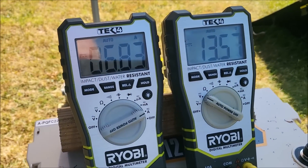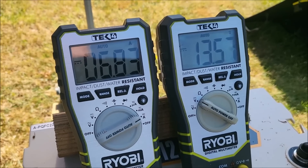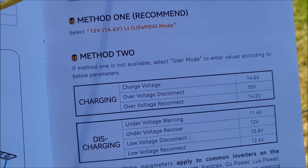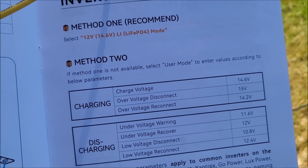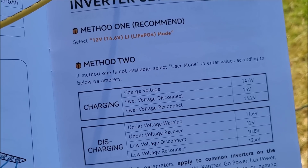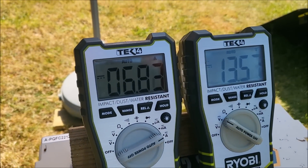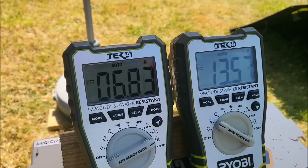There's going to come a point where the flat charging phase finishes and the voltage starts to shoot upwards. I'm going to go with the over-voltage disconnect — I'll let the battery disconnect at 15 volts. Now 15 volts is 3.75 volts per cell, which is a little bit high for Lithium Iron Phosphate, but not dangerously so and not if it's only for a few seconds. I'm actually going to wait for the current to drop to zero and see at what voltage that happens, and hopefully I'll be out here to catch it on video.